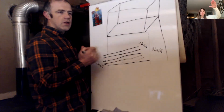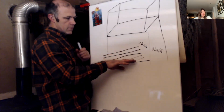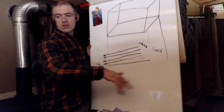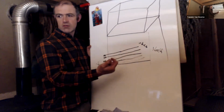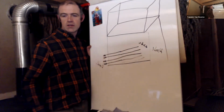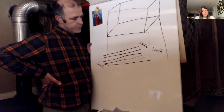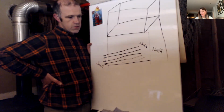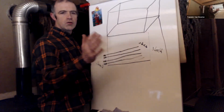But what about a room adjacent to each other? I have the living room next to the other room. If there is a room adjacent, then you need to also put the wires, because it will only have effect above it. It will not have effect on the side of it. Do you need to do anything to connect those adjacent rooms or you just lay it out per room, south to north? Yes, you just lay it out per room.